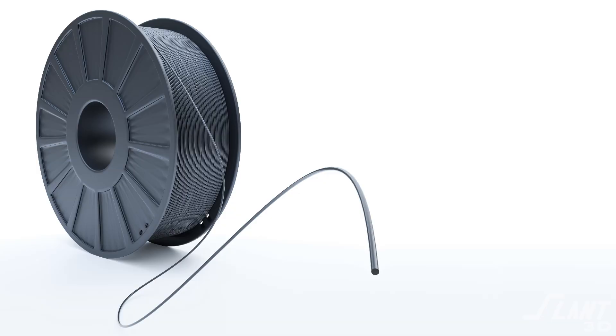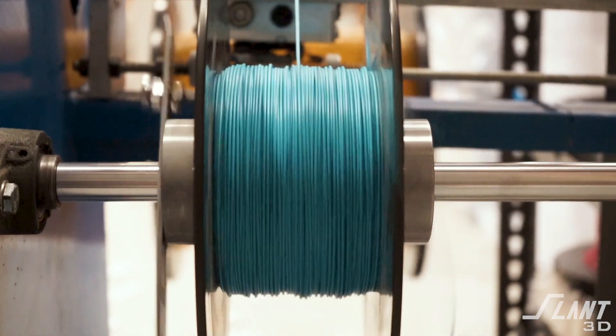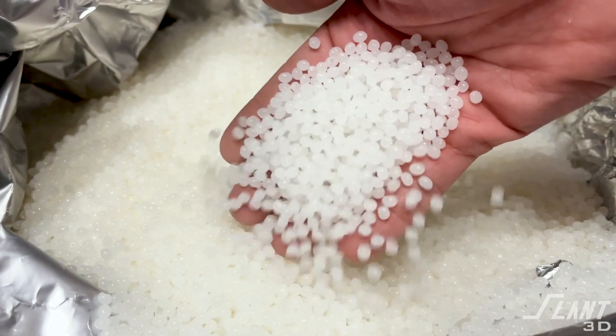Here's the situation: if you go to a general retailer like Amazon and you purchase a roll of filament, and it says something like PLA or PLA+, those are not actually precision engineering references. There are many different variations of PLA and PLA+, so a manufacturer can slap whatever logo they want on there, but they're not really held accountable for what is actually on the spool. What is on the spool can change your print settings, the performance of the parts, the appearance of the parts, and actually what the actual cost of the material should be — if they're using recycled PLA, are they using virgin material?